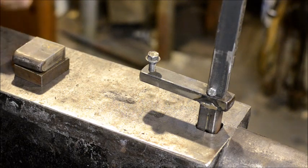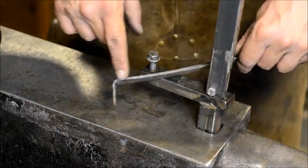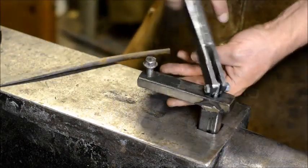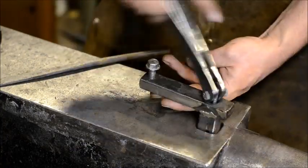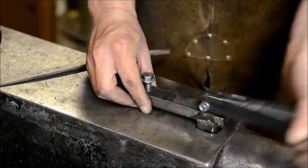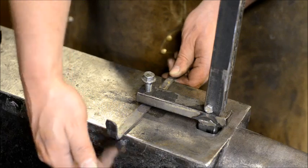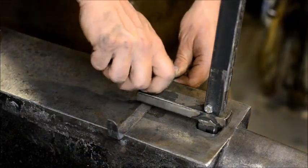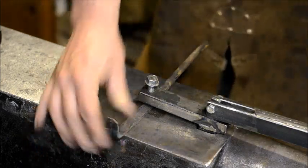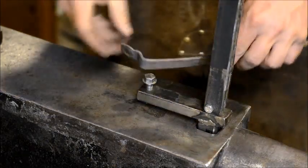Just give another short demonstration. One of the hardest bends to make is a short bend right after you've already bent something — it's very hard to make a really short bend going the opposite direction. But with this tool, all you have to do is crank the tool down. This doesn't quite fit my hardy hole and that's okay — we want it to have a little bit of space there. Crank it down close to the side of the anvil, put your material underneath with about half inch stick out, run your thumb screw down until it touches the material, and lock it down. That's not going anywhere. Then just hammer your reverse 90 there, loosen it, and there you go — 90 and a 90.